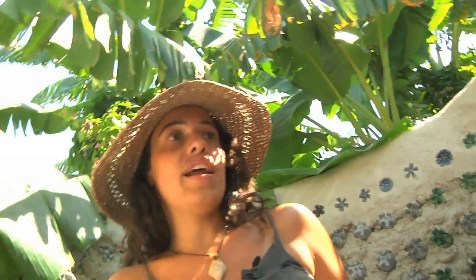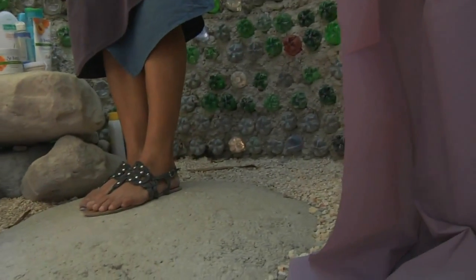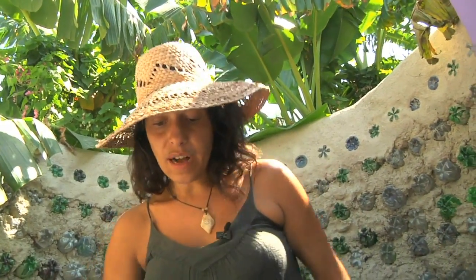When you live in an Earthship, you have to re-look at all the products that you use. You don't want to be putting any chemical products that can kill plants, because your plants are going to be drinking the water that is flushed away in the gravel here. So this is the shower — you take water from the cistern to do laundry and shower and all your needs. The water drains into the gravel. Underneath here is a hole lined with thick plastic. All the holes that we dig are contained with plastic — that's really important so there's no toxins, nothing gets out. The water just drains into the gravel and comes out, draining right out into a pipe going out to the first botanical cell, which is the greywater botanical cell.